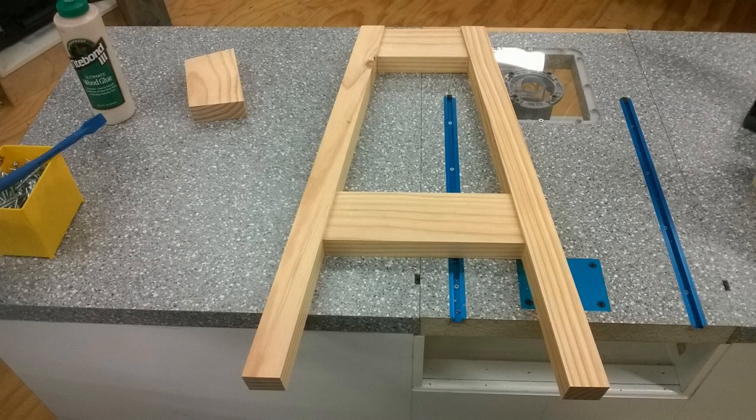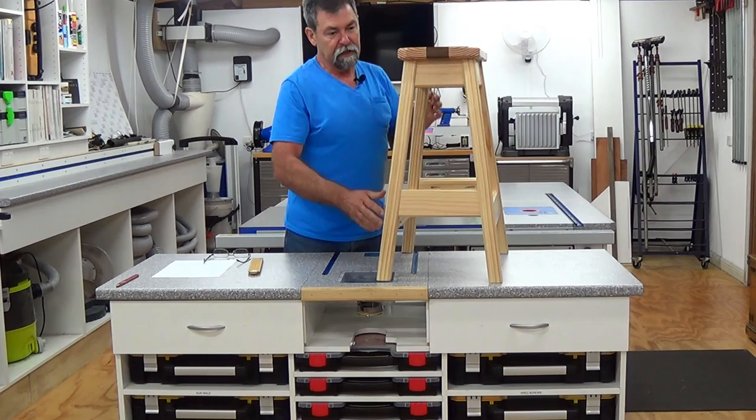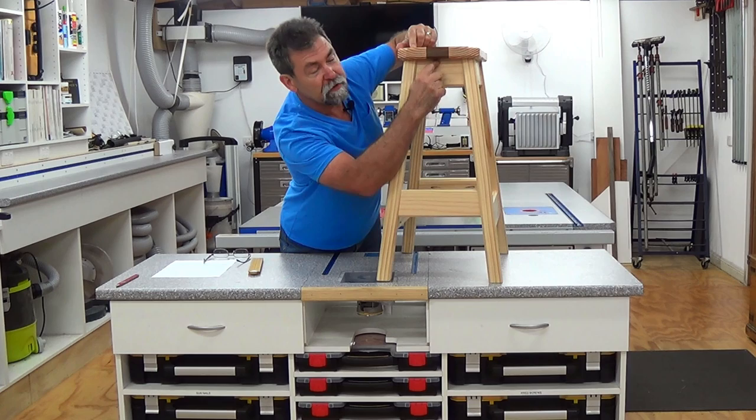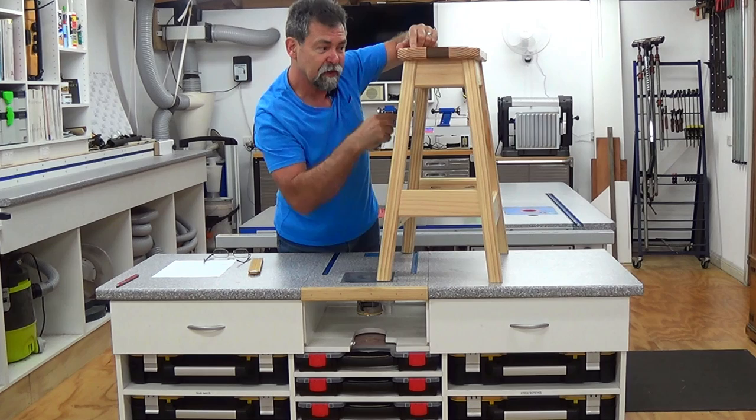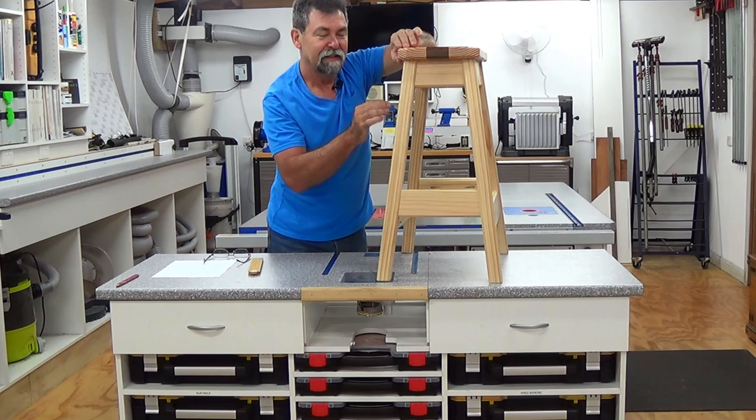And you'll notice that it goes together quite easily. I'll show you up here. Up the top here, you'll see that the piece of timber touches the underside of the seat, this rail. Now, because we're on 7 degrees, the inside of this rail, I might show you a photo, is going to be lower down because we're dealing with angles here. So just set it up so that it's there.